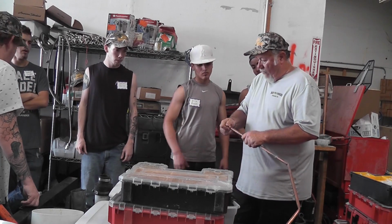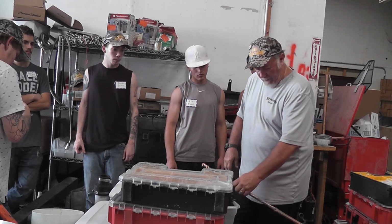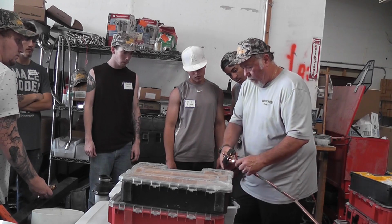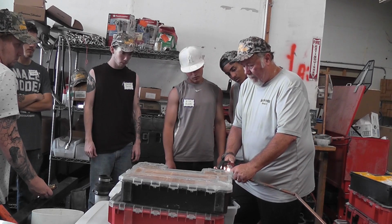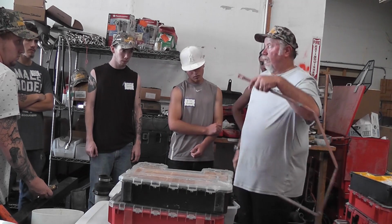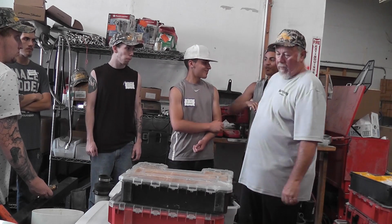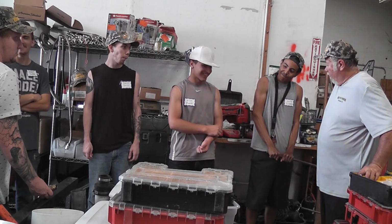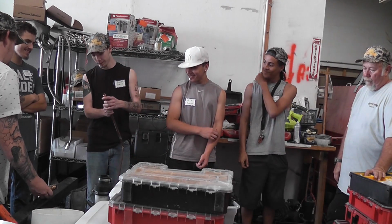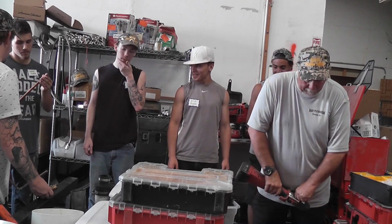On new copper, they recommend you don't sand it. You need full size pipe. Pop that little bugger on there. Open the jaw up, just like that. Fingers clear. It uses 4,600 pounds of force. So I can pull it off. Go ahead. Show me how much you can. I don't have $10 to give. That's a ProPress.